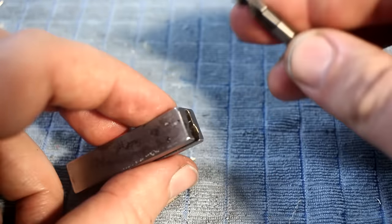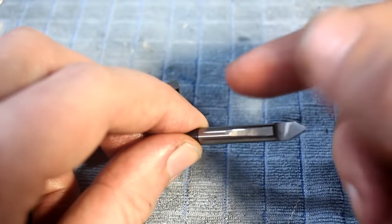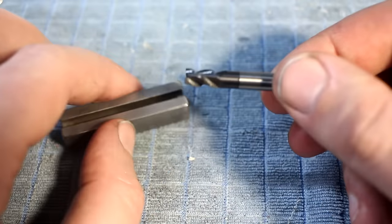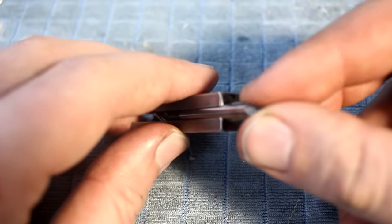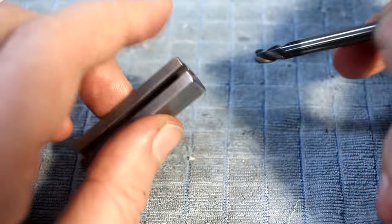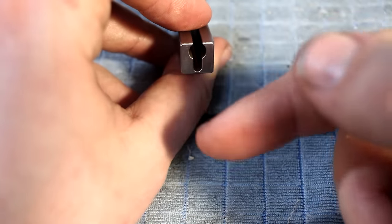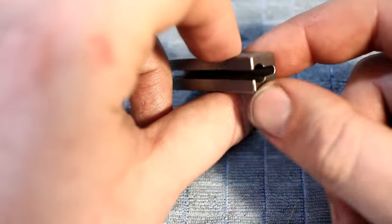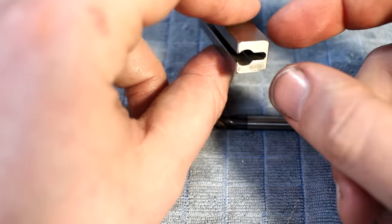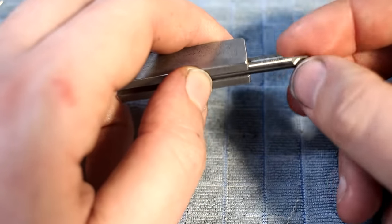Oh, and one last thing in regards to lathe tooling. I do not like V-block tool holders that have a V cutout where the round tooling goes in. I don't like them. I make things like this with a precision fit on the shank, and then I slit them almost all the way through. Out of laziness, I did this standing upright, and I milled the slot with a 3mm ball end mill almost all the way through. Then I case hardened it using a case hardening compound similar to Kasenit, and cleaned it up. That's my tooling block for 6mm round shank tooling.